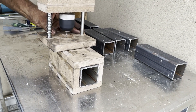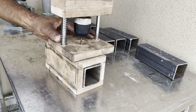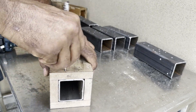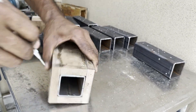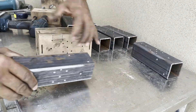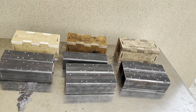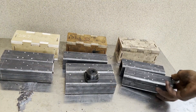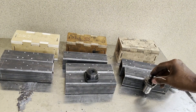I used this tapping tool to mark the hole locations on the tube. The idea is to make a dent in the steel that can later be drilled out on the drill press. I also scored lines to indicate the recess into the base, as well as where to cut the top of the tube. Although all the holes could be marked with just one jig, I ended up using three different jigs to avoid making mistakes on the different hole patterns needed.